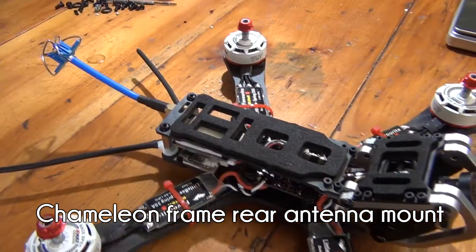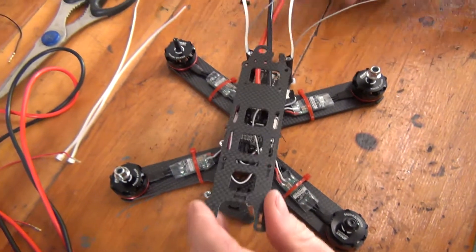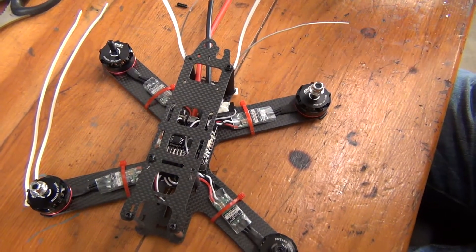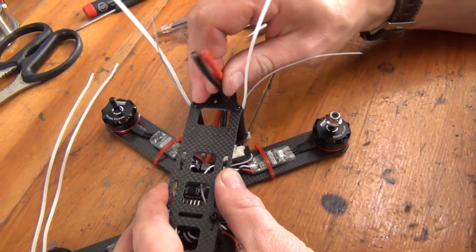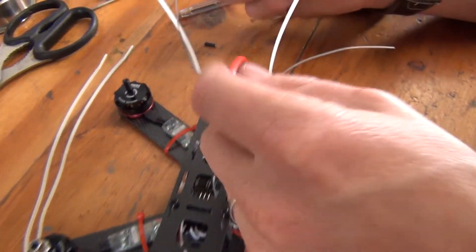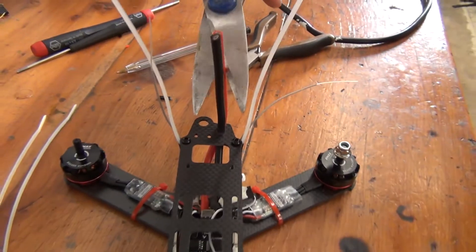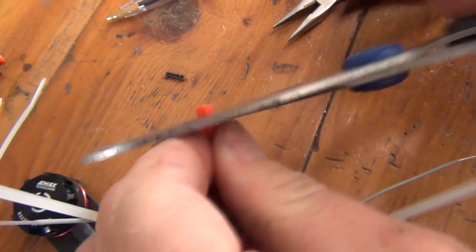Your main goal is to keep the antennas away from your props. At this point, you may find it helpful to attach the top plate from time to time to check the fit of various components. You don't need to screw in all the bolts — just attach a few to check for fit and make adjustments to your layout and wiring as needed. If you plan to mount your battery on top of your frame, now is a good time to size out your battery wire. Take the two large battery wires that we soldered to the PDB or flight controller, depending on your build, and run them to where you want to mount your battery. Cut away any excess wire and strip a bit of the silicone covering away.